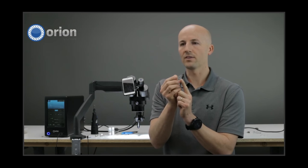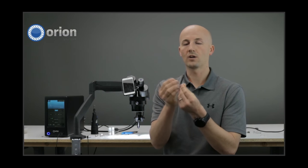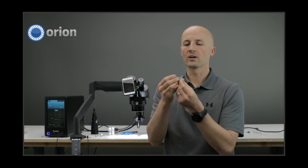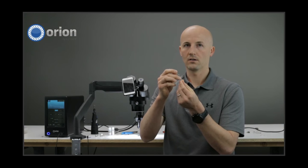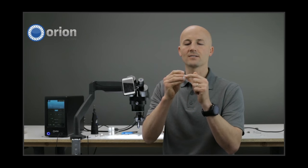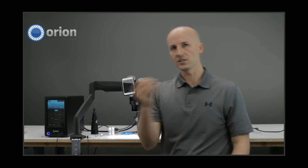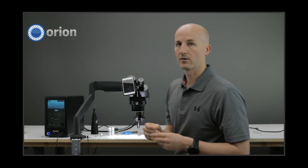Remember that — it's a really important thing. If you keep touching the wire, it's either going to ball it up or make a mess of your electrode. You're still sometimes going to touch the wire, but you need to be touching the prong first. Another thing — where you come in with the wire. We're going to come in over the diamond or stone, because if we're doing this outside prong, we'll come over like this, touch that prong, and suck that metal onto it.